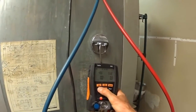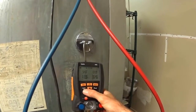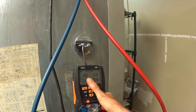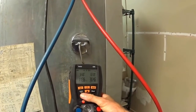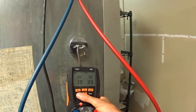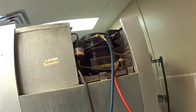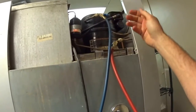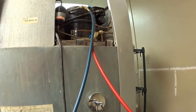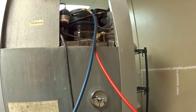Let me see if I can hit the min/max function. The 364 was how high the pressure got before with a dirty condenser. Now that we cleaned the condenser out, it's dropped down to 187. This system absorbs heat inside and takes it up to the top — it has to blow the heat off. If the condenser is dirty, it can't blow a hundred percent of the heat off, the compressor will run all the time, and you won't get temperatures. We'll probably end up putting gas in it — I'd like to get the pressures up to over 230 or so.